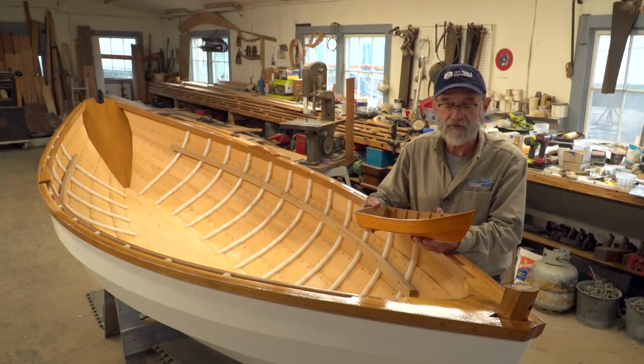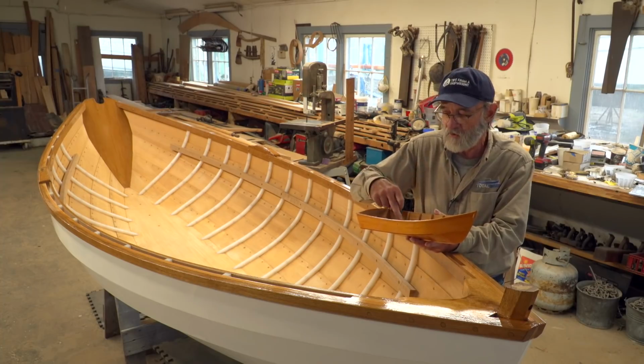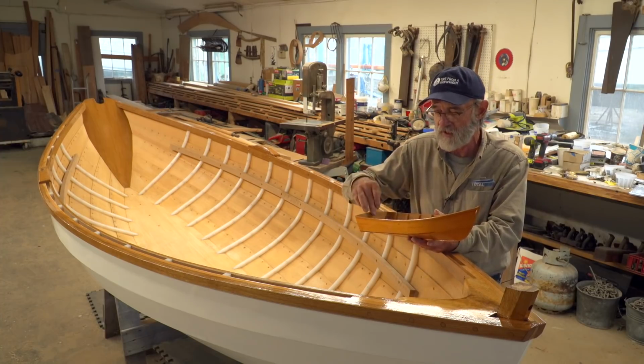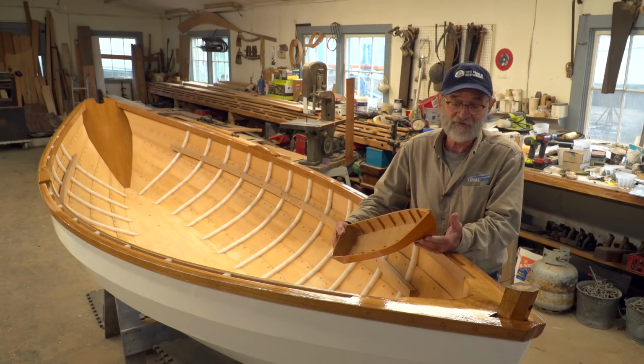It's something that I think a lot of people have always wanted to see, was somebody that would build a V-bottom skiff without all the cross framing in it that everything gets hung up on inside the boat. So this one's only going to have longitudinal framing in the bottom and cross planking. Very different, fun. This is going to be fun.